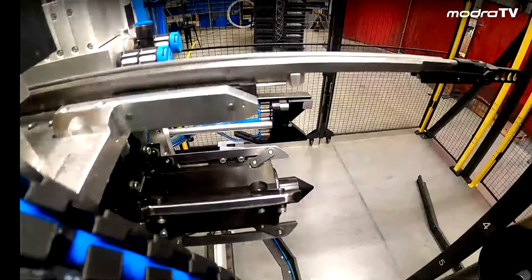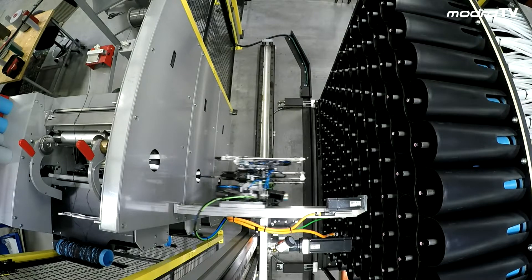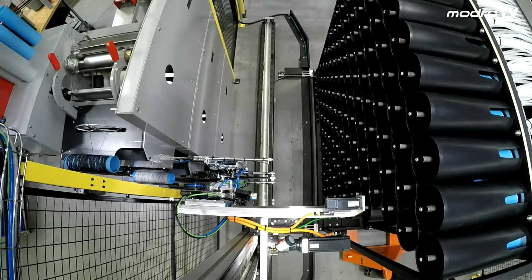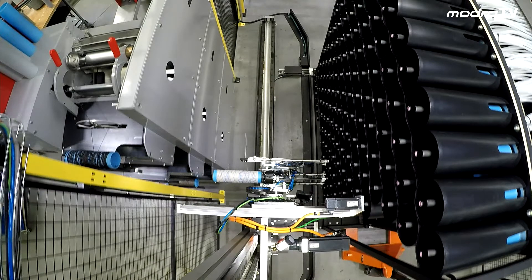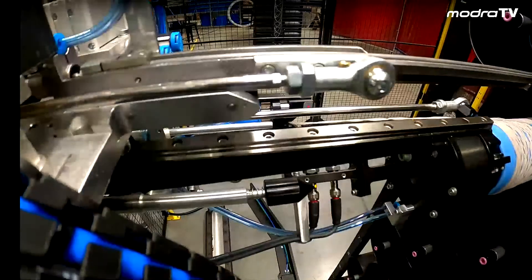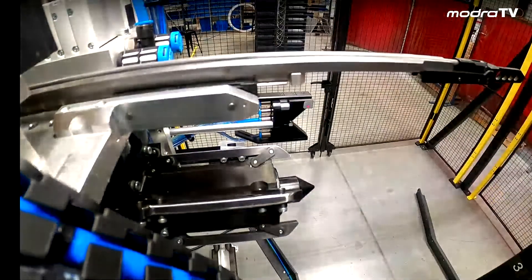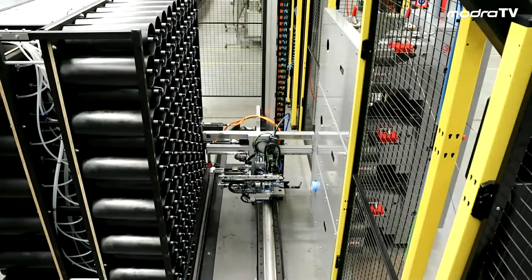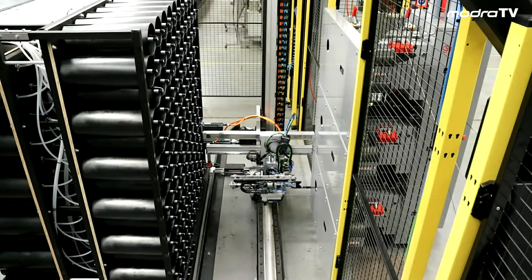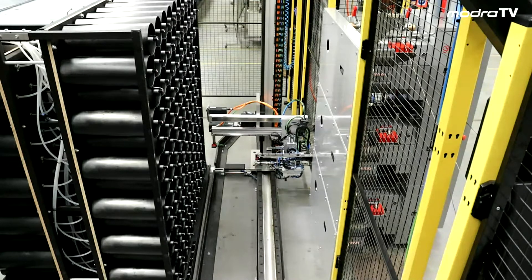The whole process of Creel MT is to remove an empty core, place the empty core into the magazine of the spindle, take a wound package from that spindle, position that wound package where we took the empty from, and to blow the yarn through a centre tube up to the top header. Each package of yarn is wound according to the yarn that's on the Creel of that spindle, and we are measuring the length of the wound yarn very accurately as well.